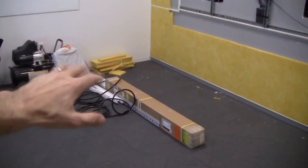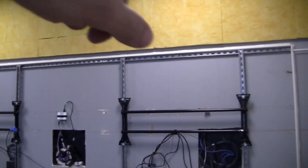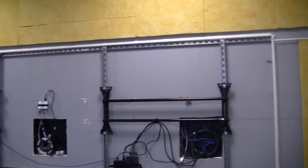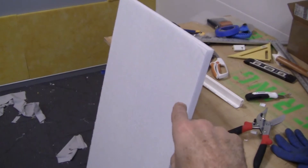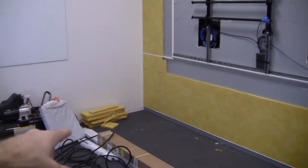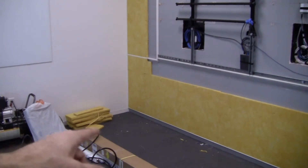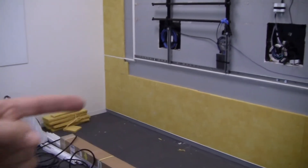I have some leftover insulation material that came out from underneath, but I've raised the frame up so those are no longer the right sizes. I need to figure out how I'm going to work with my ReCore material. This is the ReCore I purchased from the FabricMate website — it's one inch thickness, two feet by four feet. I didn't plan on redoing the whole wall. The insulation the previous contractor used was so soft that when I tried to use my staple gun to adhere it into the wall, the staple gun was going directly through it.